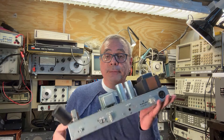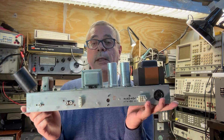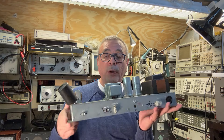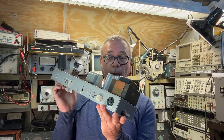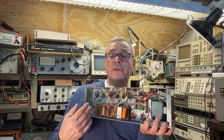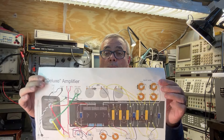I was able to acquire this — we all know what this is. This is a tube amplifier from a Hammond organ or keyboard. I have two of these; the first one I made into a tube amplifier. What we're going to be using is this chassis, that output transformer which is a 6K–7K to 8-ohm, and that power transformer which is a 300-volt transformer. We're going to gut this out, clean it up — a lot of folks will repurpose this and turn it into a tube amplifier.